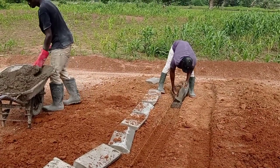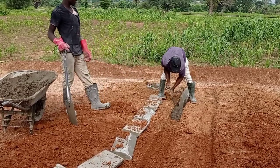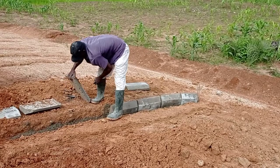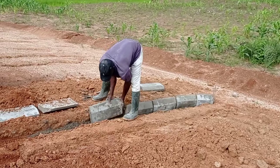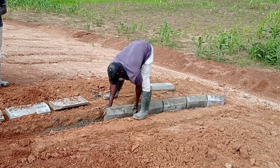With the help of a building line, you can see that the mason is placing these curb stones. Before laying the curb stones, you can see that the concrete was poured in. The thickness of the base was maintained at seven to nine centimeters.